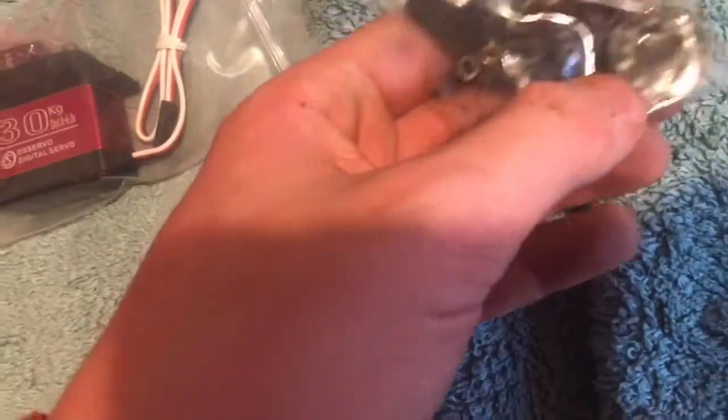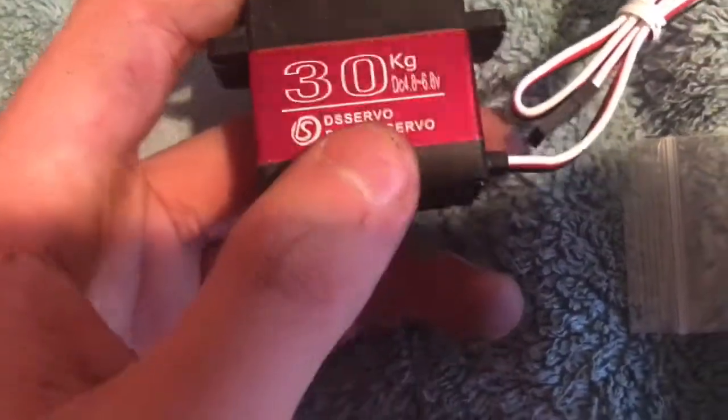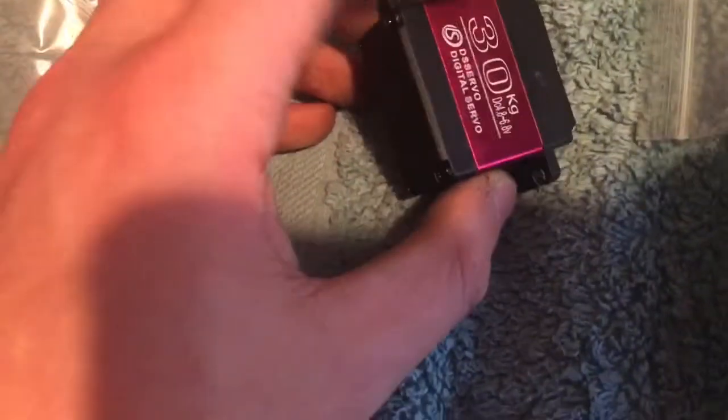I forgot to film but I literally just took this out of the packet. There are loads of servo accessories in there but I'm not gonna need them. There's the metal servo horn, 25 tooth — nice. And here's the servo itself; it's a digital servo — I'm not sure if that's a brand or just off-brand. We're not going to install it yet — we're going to plug it in and check if it works first, because I don't want to go through the hassle of putting it all back in if it's not going to work.